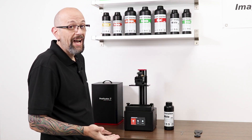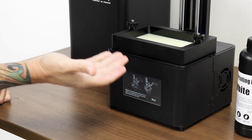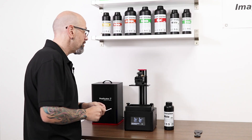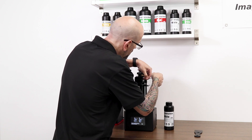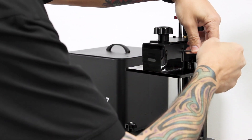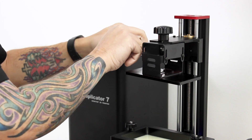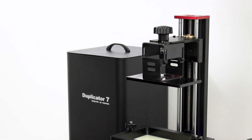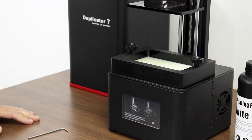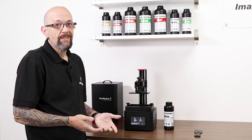You should be wearing gloves for this — I'm a rebel. So now we're going to go to the utility screen and just hit level. But first we're going to take this Allen wrench and unscrew these four screws. You'll notice as soon as you get the fourth one loose, the bed starts to fall. Now the bed is nice and loose — we're going to hit next. It's going to lower the bed right to the surface, touch the film, which is flat with the FEP, and then we're going to tighten the screws. It's not rocket science — it's leveling.